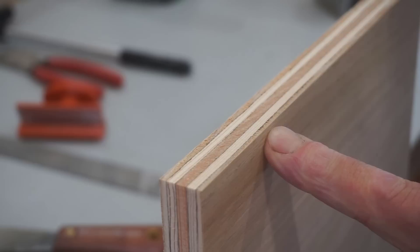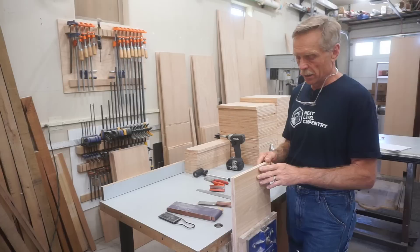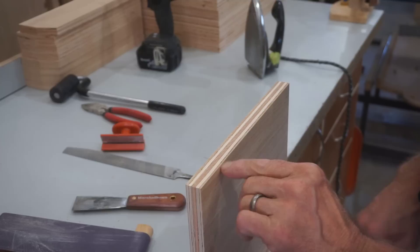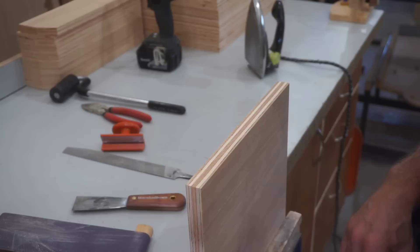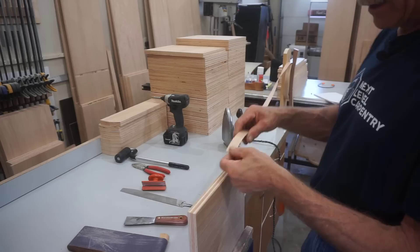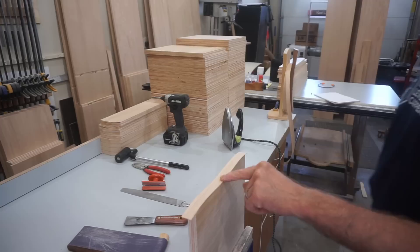Here's a close-up shot of a crisp, clean, square, smooth edge that's ready for edge banding. All these initial steps are the same whether using melamine edge banding on particle board or the wood edge banding — there's one step at the end that's different between the two. The first step I always do after clamping the board is to wipe the edge just to make sure there aren't any loose splinters of wood or sawdust on there. Generally a wood or particle board will have a nap to it depending on the way it was run through the table saw — kind of like fish scales. I just wipe that off and make sure there's no chips or splinters on there.